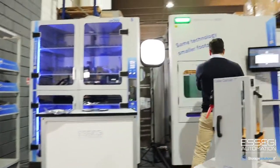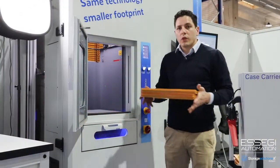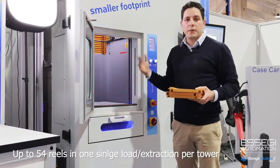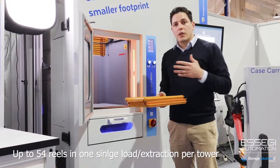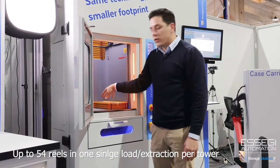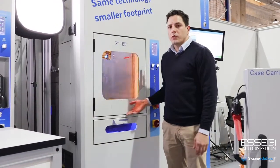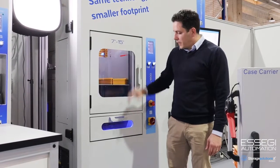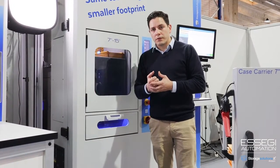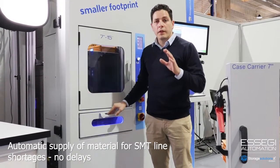Here we have material extracted from the ISM 1800, an automated storage that prepares material automatically. Operators collect it easily — we can stack up to 27 cases, meaning 54 reels at a time. Loading material back is as easy as collecting it: position the cases here, a camera reads the unique IDs and barcodes on the reels, close the door, and press Insert. The machine loads back automatically. If an urgent reel call comes from the SMT line during loading, loading pauses and the urgent reel is delivered from the drawer — the SMT line is never stopped.